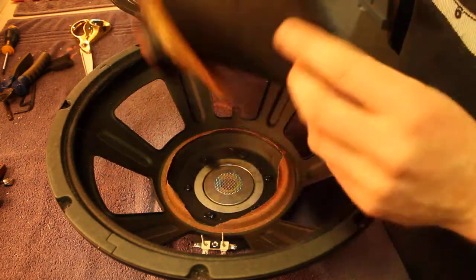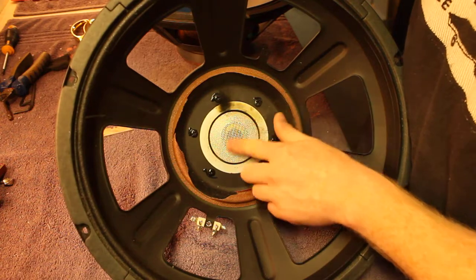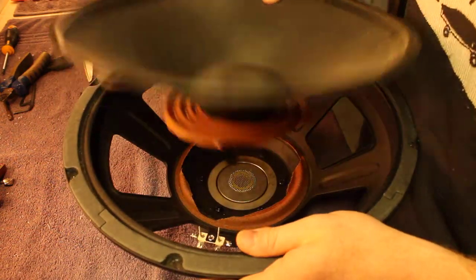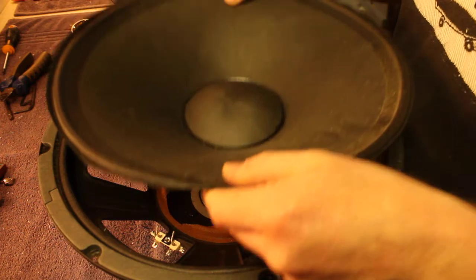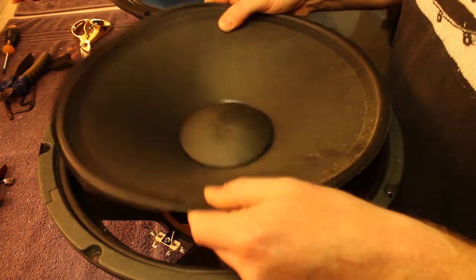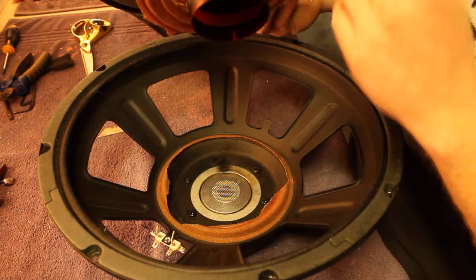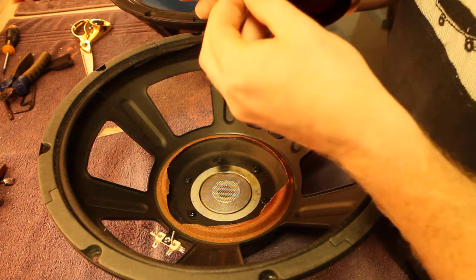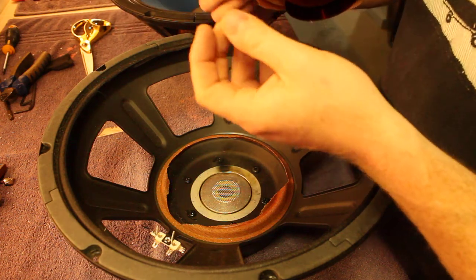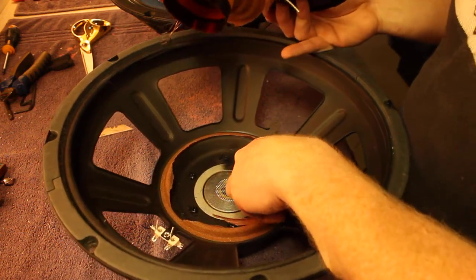Normally the cone has nice movement — constant airflow — and that coil relies on airflow. You can see the vent there which helps with airflow; as the speaker cone moves it pushes air in and out, cooling the coil. With a square wave, it's less smooth movement — at those extremes the cone isn't moving at all, so there's far less cooling airflow.